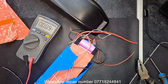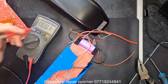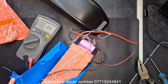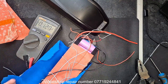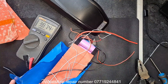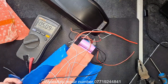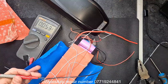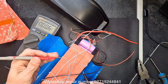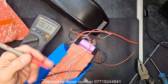Multimeter on the side — going row by row from the top, 13 rows, checking each row to make sure the voltage matches within 100 millivolts. First row: 3.7 volts. Second row: 3.874 — checking first row again, 3.78 — still within 100 millivolts, that's fine. Row three: 3.8. Row four: 3.8. Row five: 3.8. Row six: 3.8. Row seven: 3.8. Row nine: 3.8. Row ten: 3.8. We've got a usable pack.